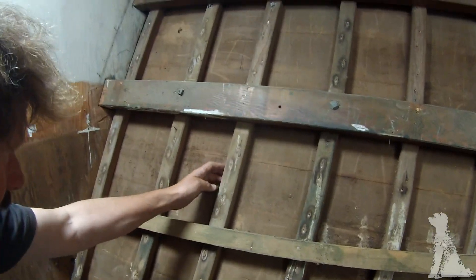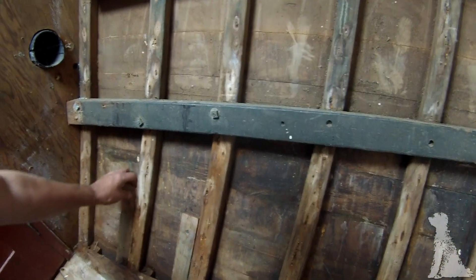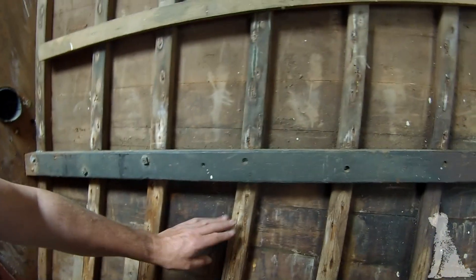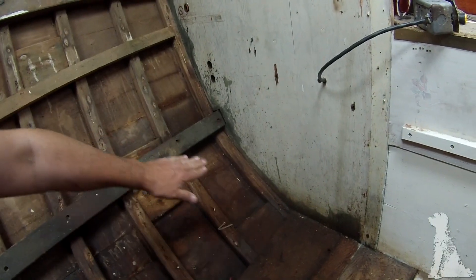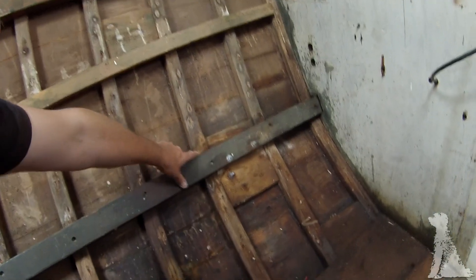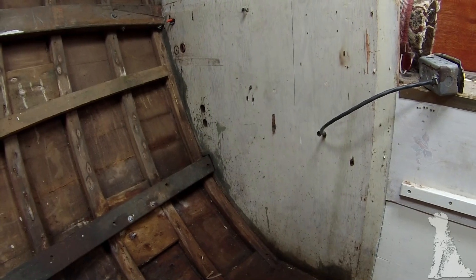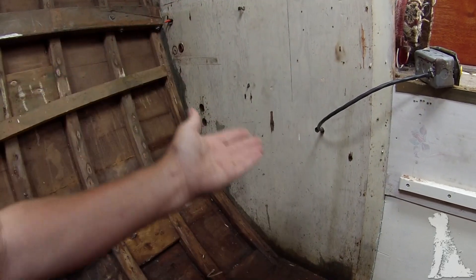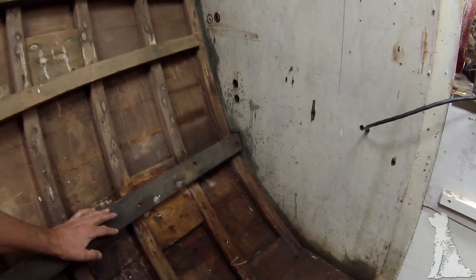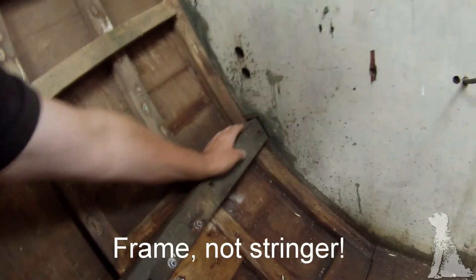In terms of structure, the galvanized clinch nails start to get a little more distressed as we work our way down. Up here they're perfect, here they're not bad, but further down we're starting to see some deterioration - from this stringer down these are actually a bit punky. Someone's added some cheap sistering pieces. This boat has an interesting hard chine that starts right here - the ribs follow a perfect curve until this point, but from this rib back there's a fold that gets sharper toward the stern. Right here is the biggest problem - this rib is broken and the stringer has moved out almost half an inch.